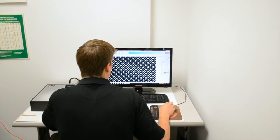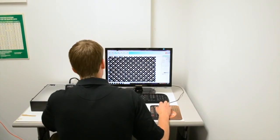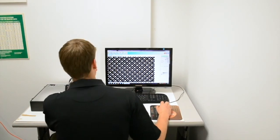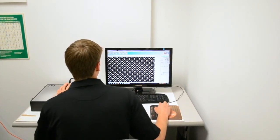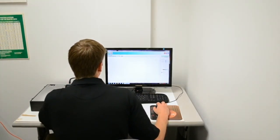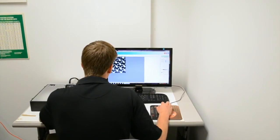The Betaflex Pro allows you to capture and analyze dot percentages on the plate. Measure a determined tone scale and record the measurements for each dot percentage that was imaged. Over time, develop an acceptable tolerance of what these dots need to measure to pass an inspection. The Betaflex Pro also allows you to examine the dot structure in 3D, so you can determine the likelihood of failure on press for these highlight dots.